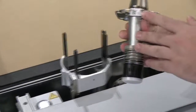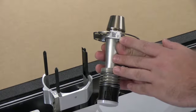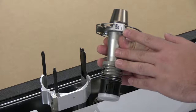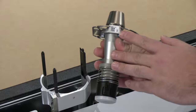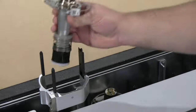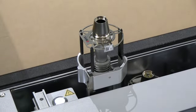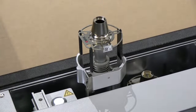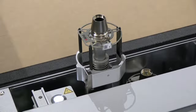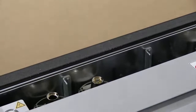All of the tools for the Q-Line come with a DMC code printed on them so the cutter can recognize them automatically. We can use this with our new TOMAC, or tool management center, to pair these with blades that also have DMC codes printed on them. This allows us to track the life of each blade individually and ensure we're maintaining our maximum quality of cuts. I can also export my required tools for my production schedule to prepare them away from the cutter ahead of time. I'm able to select which tool I want to work on through my software interface, but I can also quickly switch with my button here in the magazine, moving along to the next one in the slot.